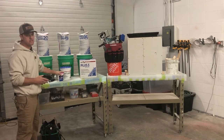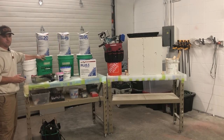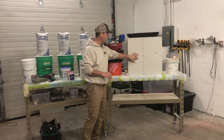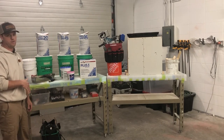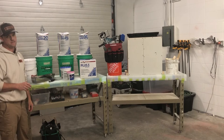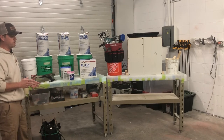Another advantage to joint compound is that it's a lot easier to sand. Whenever we're using the 20 or 45 minute mud, we're typically going to be sanding with the Festool vacuum with a surf prep five-inch sander attached, using 150 grit. It creates a little more dust because we're usually leaving the surface a little more proud — meaning there's more mud on the surface to sand down. But with lightweight spackle and joint compound, we're going to be pinning coats tight — scraped all the way out flush to the drywall surface — and then just doing some light sanding with a fine sanding sponge.